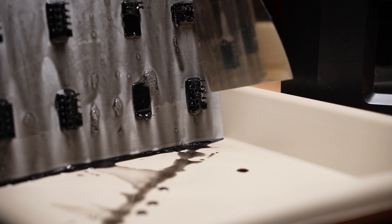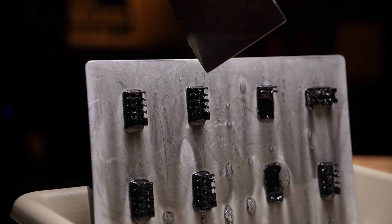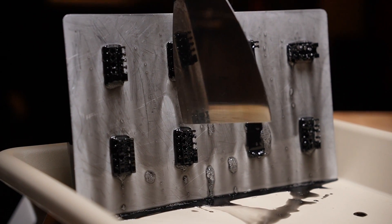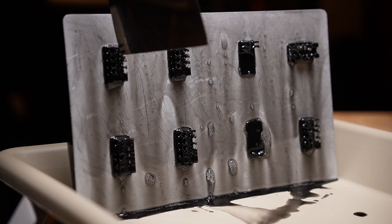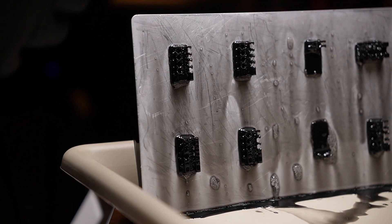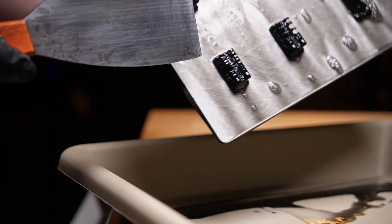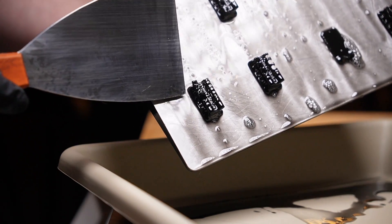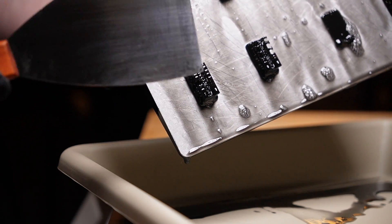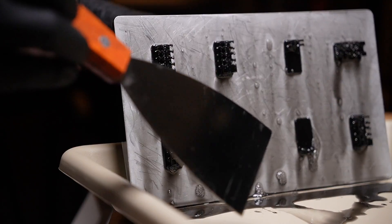Our 1.75 fared a little bit better. 2 seconds is messed up. 2.25 is messed up. Yeah, even 2.5 is messed up. 2.75 and 3 seconds as well — and even 3.25 has a little bit of screwiness at the top. So these are all underexposed results. I'm going to run the print again, starting the next one at 3.25 after we do a vat clean.